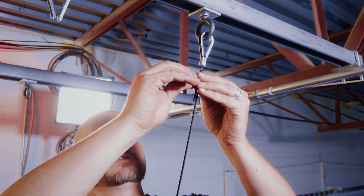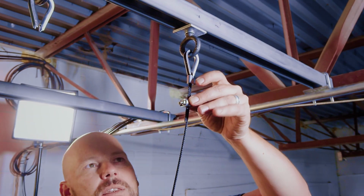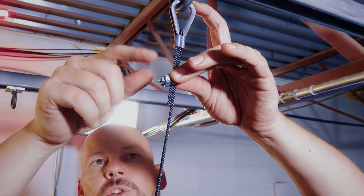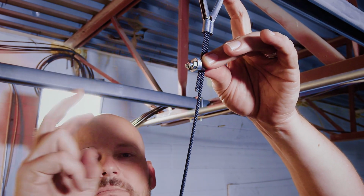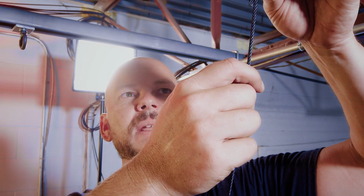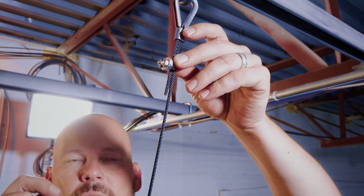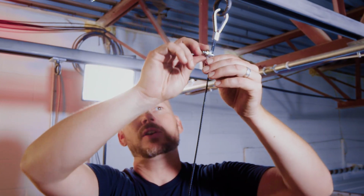There's something I want you to notice about this Crosby, okay? In this example, we have 2 wires, right? Now I know that it's 1 wire that's looped over, but there's technically 2 of them. The long one is our dynamic one. It's the one that's actually gonna be taking a load. The short one is our dead one. And there's a saying in Crosby world, never saddle a dead horse.